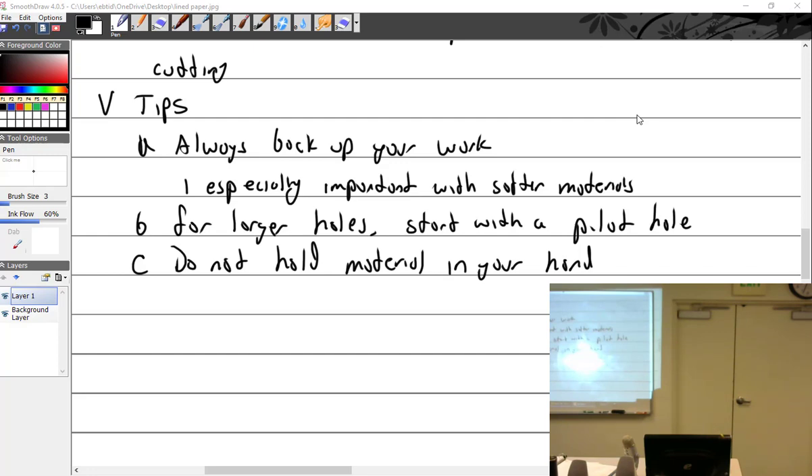The pin vise for the little bits. I was surprised — number 80 is how small they are. Step drill — sometimes called a step drill or Unibit. These are a must-have in aviation. If you're trying to punch a half-inch hole in a piece of 0.032 with a drill bit, you're asking for trouble. These things will put a nice perfect hole wherever you want.